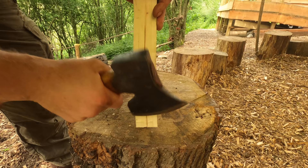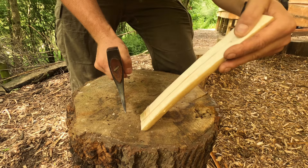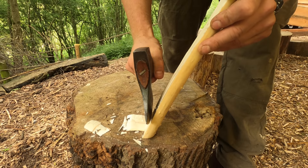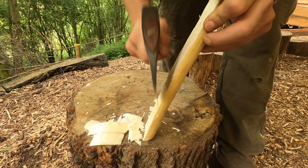I'm going to use the front of the axe to do very small up-and-down motions. All that's happening here is that the piece of work is getting maneuvered around and the axe is simply going up and down. Lots of little cuts with the piece of work being leant out, and then I straighten the piece of work up and drive them off — I just want to go just below the pith. The trade-off is you don't really want to be using an axe anywhere above halfway.